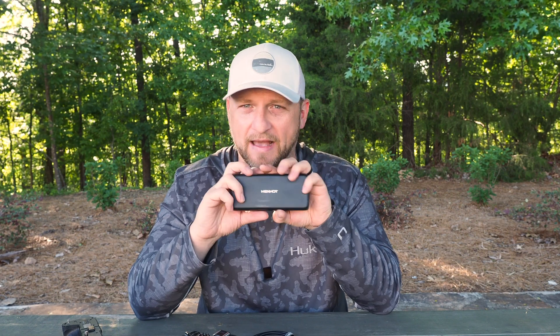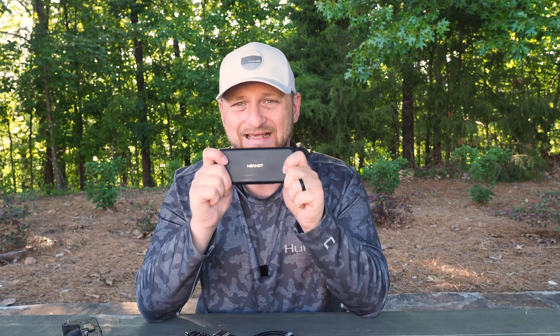Just in case I created some confusion, here's a concise equipment breakdown. The first thing you're going to need is a PD-enabled battery bank. A traditional USB-A battery bank will not give you enough power to drive this. It does need to be PD power enabled because you need the 9-volt output — most power banks without PD power cap around 5.2 volts, and this requires 9.2 volts. This one I've had since December — filming at the end of April — and I've had no issues with it, using it repeatedly for several hours of filming.